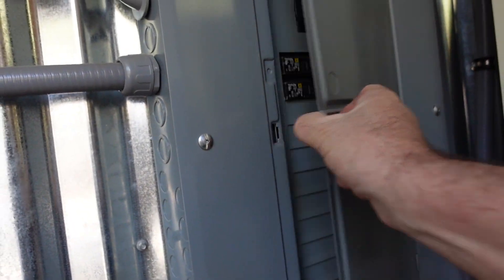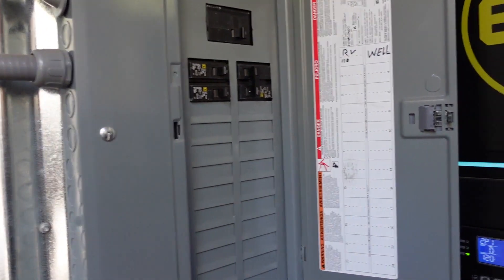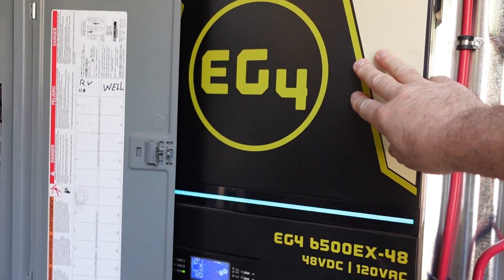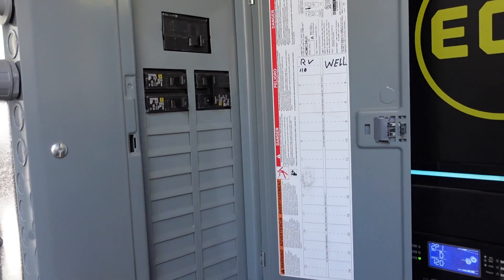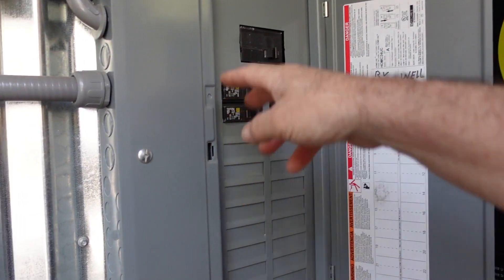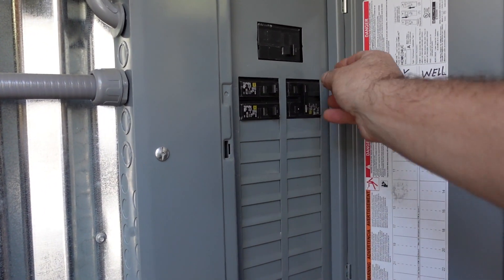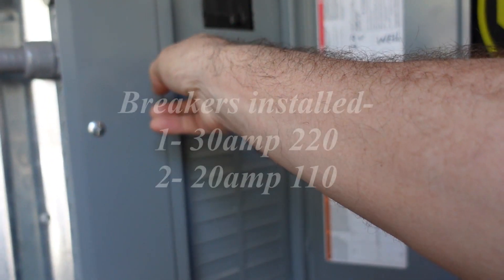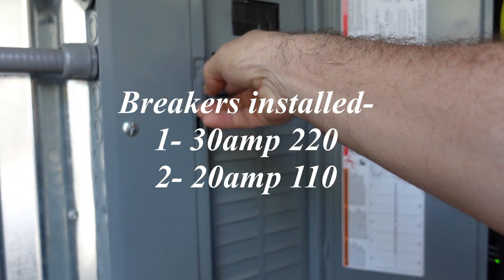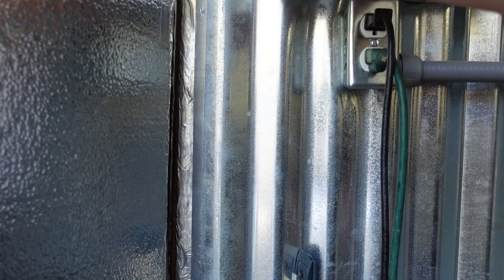The sine waves mirror each other, which gives us 220-volt power. Just like in your standard electrical system, we have 120 volts coming in from this charge verter going into our electrical panel, and 120 volts from this charge verter going into our electrical panel. If you've ever looked at an electrical panel, you have two sides — 110 and 110 — and when you combine the two, you end up with 220. This is our breaker for our well. Right now we're only running two 20-amp breakers.